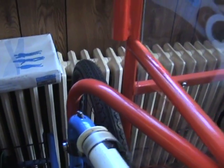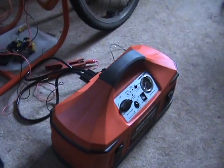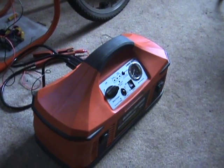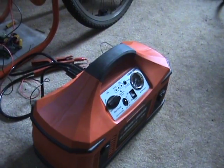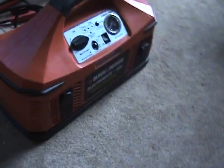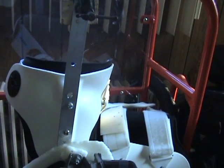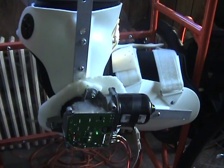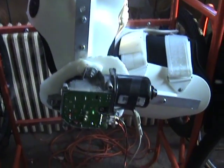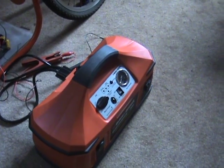Right now I just have it powered by a Black and Decker — basically a 12-volt DC power supply also used to jumpstart a car. It provides a lot of amps, because this wiper motor takes a good amount — the stall amperage is probably 11 or 12 amps. The power supply batteries will actually sit in the bed of the walker right in there.